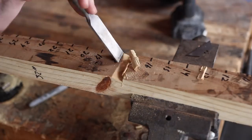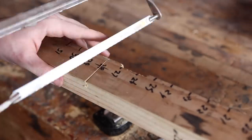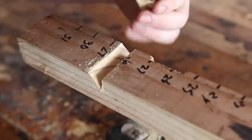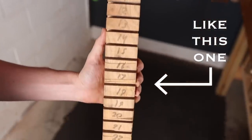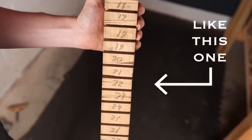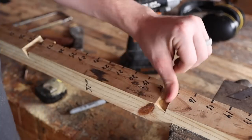The notches only need to go in about half an inch — roughly three bow string widths. With hand tools, cut horizontally into the board and chisel out the other section. If you don't have chisels, you can cut at a diagonal with a handsaw. With a hacksaw that works reasonably well too. If you have a table saw with a sled, make one cut at 90 degrees and another at 45 degrees — or just run two saw-blade-width cuts about half an inch deep.